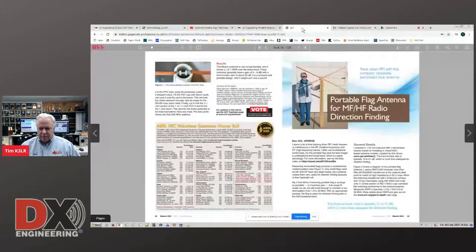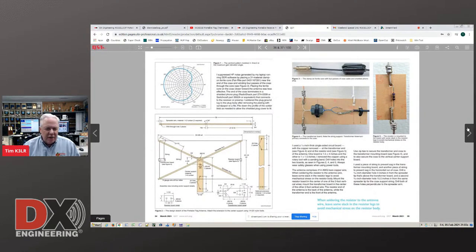Don did a lot of work on it, and we're going to have some excitement here at the end. So let's take a look at the article — I'll bring it up on the screen. This is the portable flag antenna for HF radio direction finding. The front-to-back ratio is typically 12 to 21 dB. It's a very simple design, highly effective. If we take a look at the pattern of this antenna, you can see that it's very broad off of the front, but in the back it pinches down and has great directivity. This is what we use to find noise — by looking for where the null in the noise is.